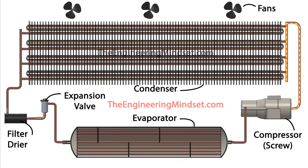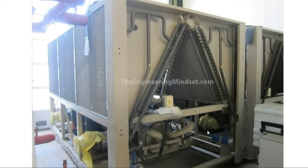We've got an animated version so you can see inside the air-cooled chiller. The compressor — a screw type in this case — pumps the refrigerant out as a high pressure, high temperature, superheated vapor and it makes its way to the headers of the condenser. Here's a real-world example of distribution headers with flow and return, running into the filter dryer.